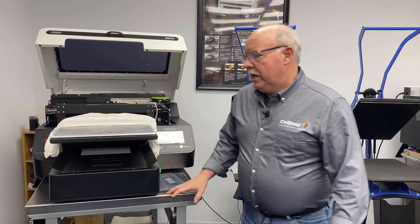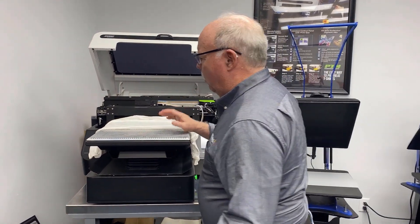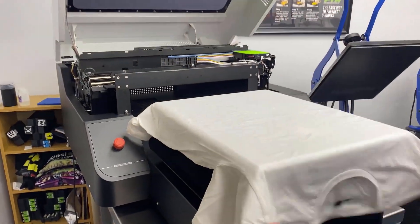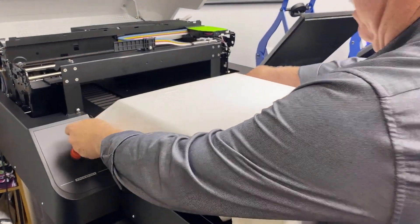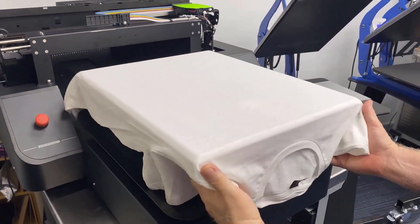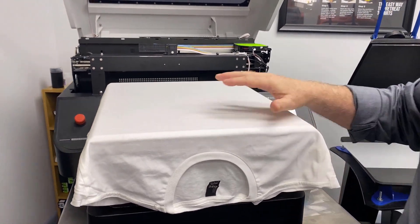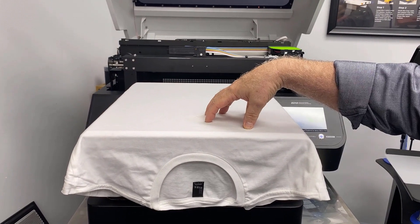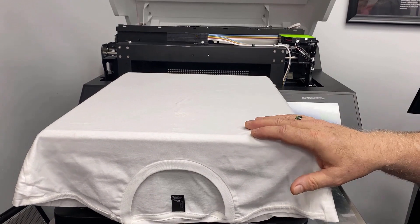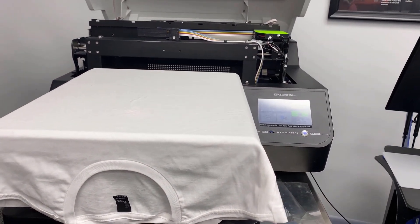You've really changed nothing on the DTG — on the G4. I'm going to start with my vacuum platen on. I'm going to pull a t-shirt up onto it, make sure it's smoothed out and tucked in. What that's going to do is activate the actual vacuum, and having the shirt on top of it gives us better hold-down than if you just lay the sheet on top of it by itself, because there's no leakage — everything's being drawn through the shirt.